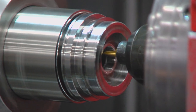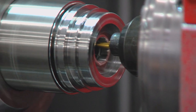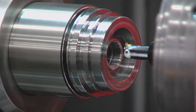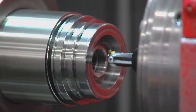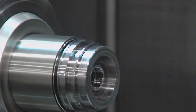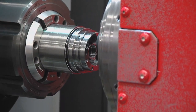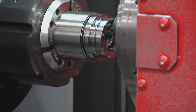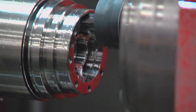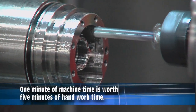The idea is to get the part off with as few burrs as possible, so we try to do about 95% of the deburring as we machine the part. It's threading now — single point threading, going in there and cutting threads. Then it'll come in with the thread tool one more time to remove any burrs left on the thread. What we're doing right here is actually quite exciting — it's C-axis rotary pocketing. It creates all the radii and features in the part and never moves the head off-axis.